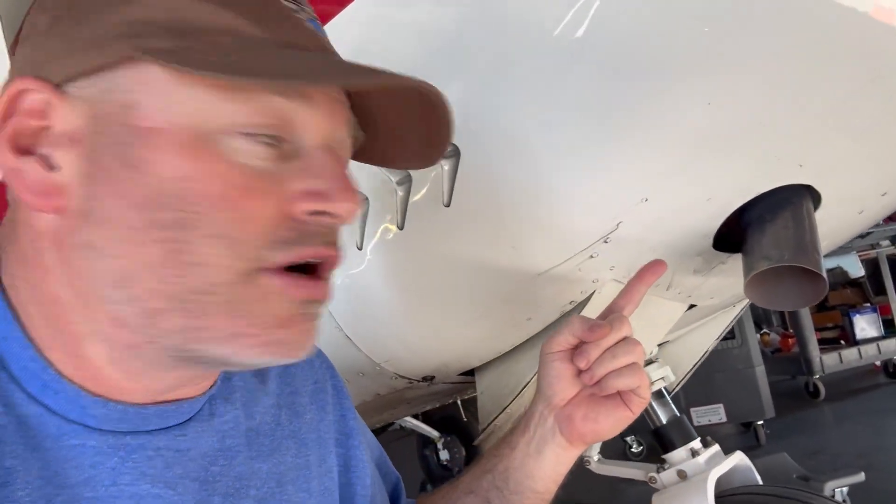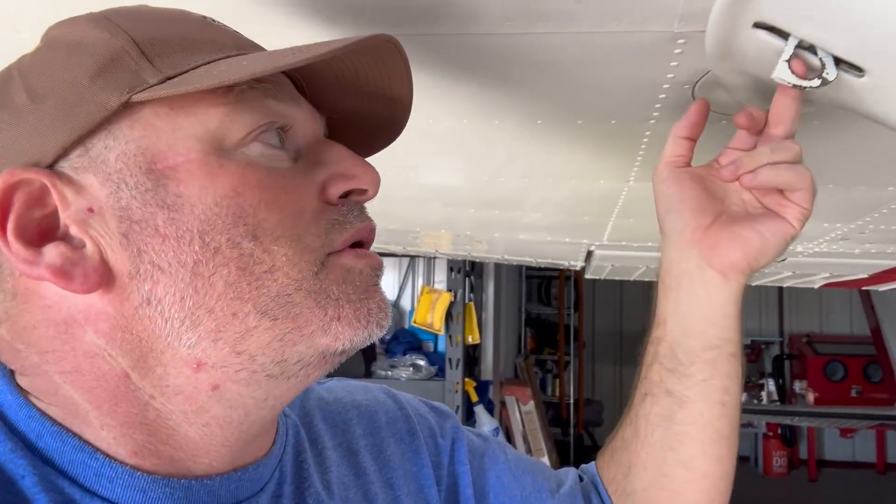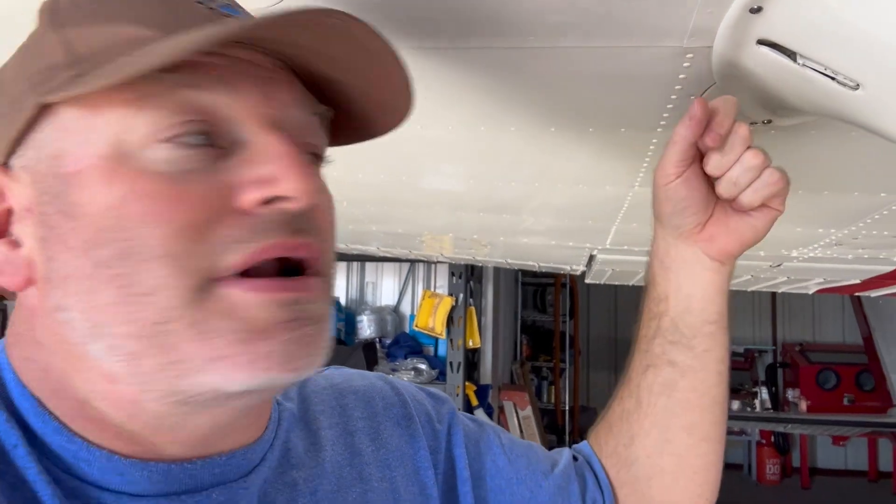So what's the solution? I'd like to find a piece of metal that grounds the airplane and is relatively low risk, low cost — sacrificial, if you will. This isn't a great example, but on a common airplane like a Cessna 172 that has a tie-down ring right here — this one is retractable so it's not the best example — but an airplane with a fixed tie-down ring, I think that's a pretty good place to ground to.